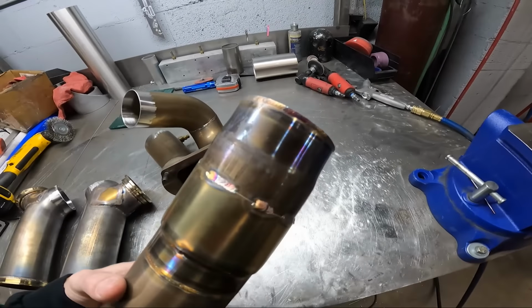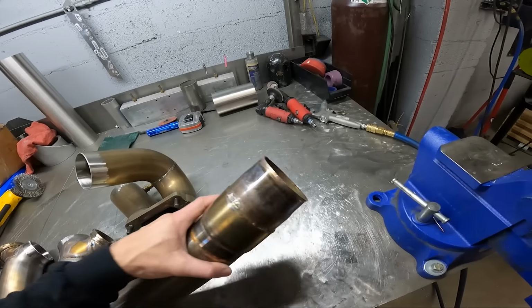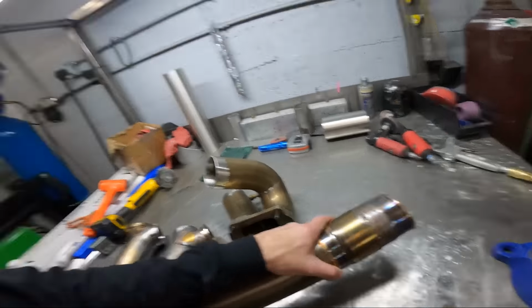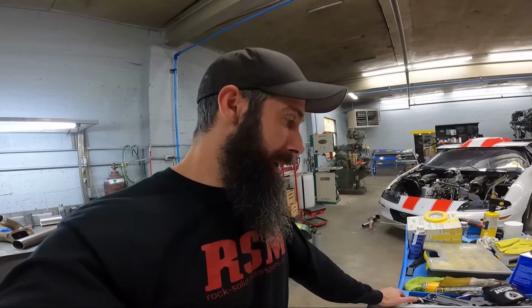And see, there's the piece we took out. We can see it's moved like an inch right there. So talking to Jonathan yesterday about some stuff that had happened. Recently, the car went and got a bunch of sheet metal work done at Jared's garage. It looked awesome. Closed up all the big air gaps underneath the car. But to support that aluminum, he attached it to the bottom of the wastegate tubes and extended the wastegate tubes where it would come out through the aluminum.